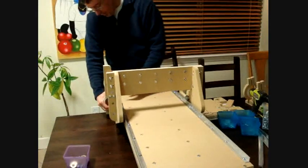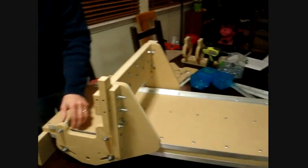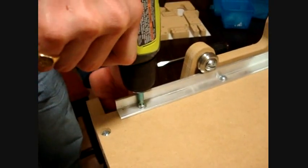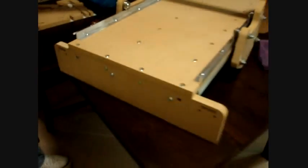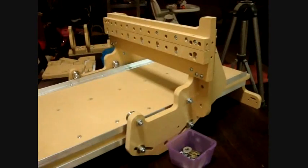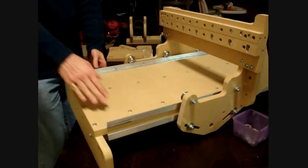Line up your bearings. Bring up the bottom bearing and tighten it as much as you can with your fingers just to keep it on the rails. Your bearing should be pretty tight and you'll see what kind of space you need to start tightening the rails. I'm going to have one side here on the edge of the MDF and tighten it down at that point, starting with one screw, flat against this edge. Everything will work off of this, so make sure it's close to this edge to get as square as possible. Tighten the bottom pieces on both sides so they're tight against the rail, then you can tighten this side.